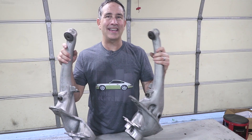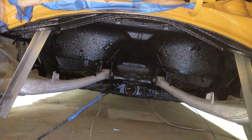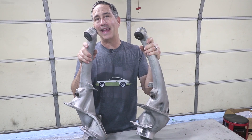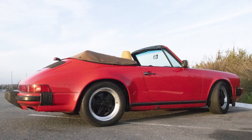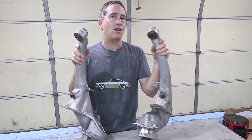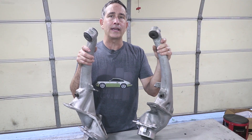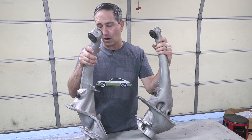This week it's all about these banana suspension arms for the rear of a Porsche 911, and I'm going to try to determine if these are bent. These are the ones that came from the red car and I think one of them is bent for sure. But I'm also suspicious about the banana arms on my yellow car Mac, the 1974 backdate. So I want to develop some tooling to determine if it's straight or bent, or how far it's bent.